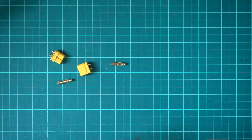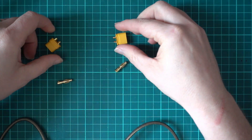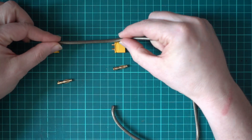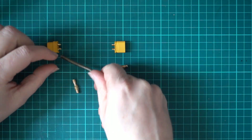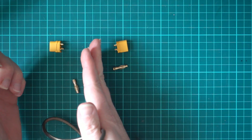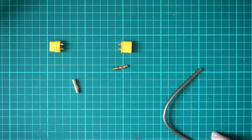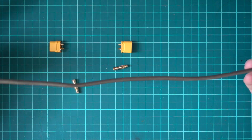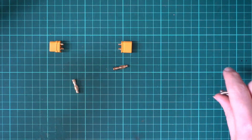So the first thing we're going to do is solder up the negative. The basic schematic — I'll draw it out on the table — we have our two plugs: the negative wire goes straight between the two negative terminals, and then each of the positives will go to a bullet connector. So effectively the positive line is broken and that goes in between the amps and the common on the multimeter. I'm going to use about a 45 centimetre long piece of negative, and I'm going to make the positives slightly longer so we can get those into the multimeter with no issues.